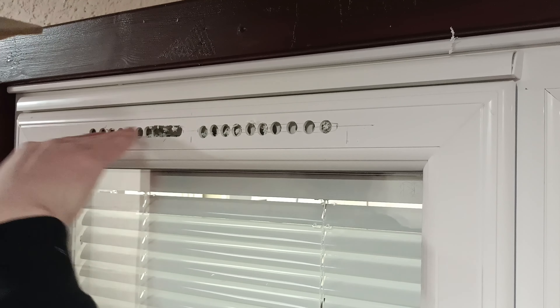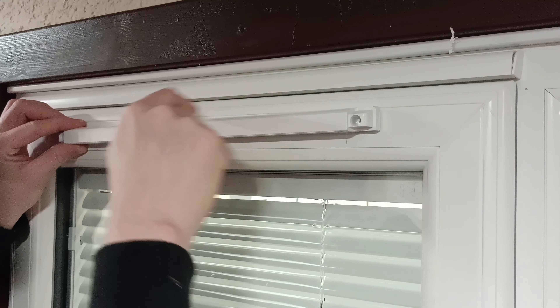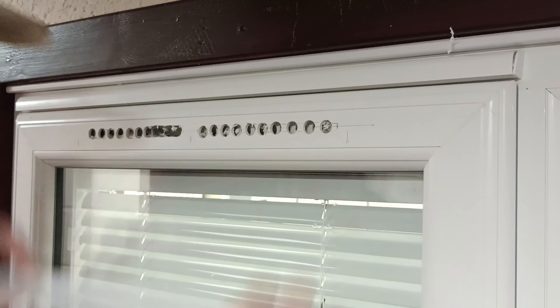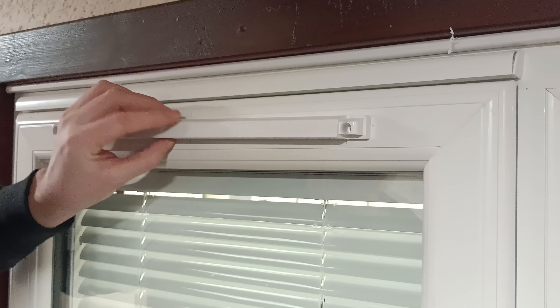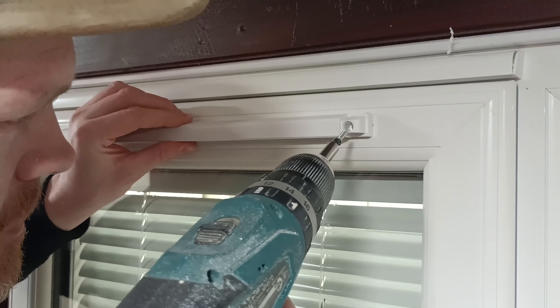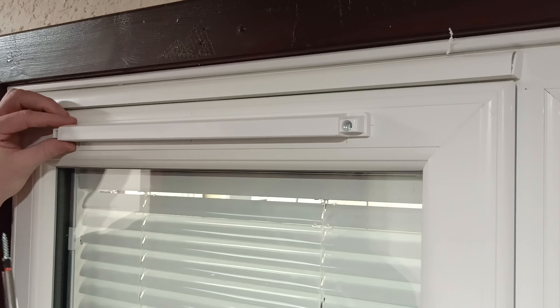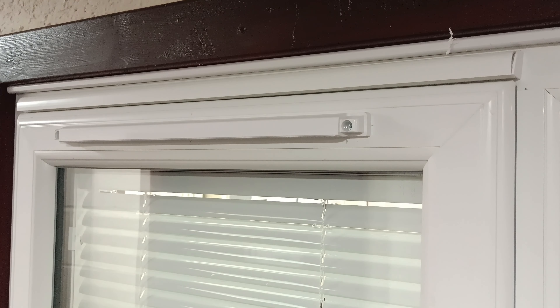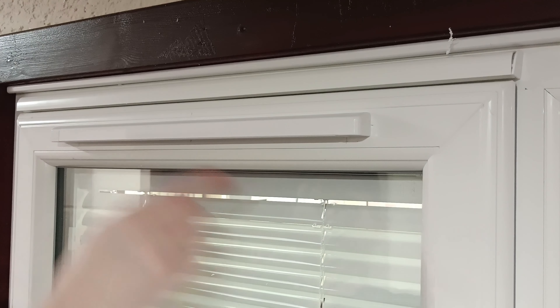Now with that done, you can see straight through. Then you just repeat this process on the inside. When you put your vent on the frame, put a little 5mm packer at the top, as explained in my previous video — I'll put a link to that video. You've marked everything up, you know your centre — find your centre line at the top of your vent again, then just screw your vent in. Make sure everything is nice and level. Pop your end caps on. I'll put a link to these vents in the description also. And that's your vent installed on the outside — just give a wee clean with solvent just to get rid of the pencil lines.